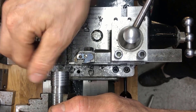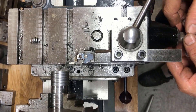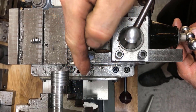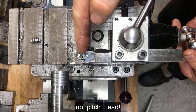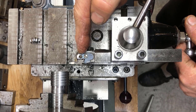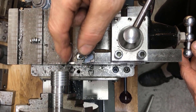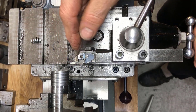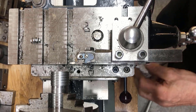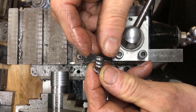Here is the threading as far as we have managed. Not complete, but you can see how it becomes a square thread with 3.175 millimeter pitch. The only thing you have to do is remember to retract the tool and set the new depth — that's the only hassle. It would of course be better with the second axis enabled, as then you'd also be able to use the other portions of the threading program.